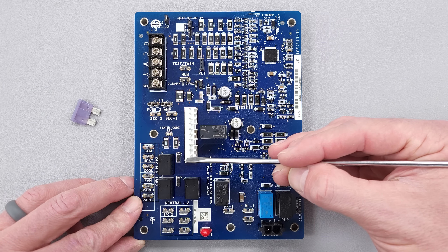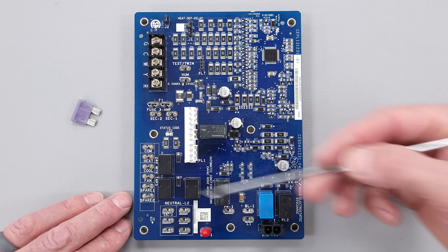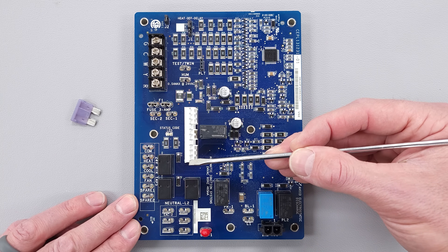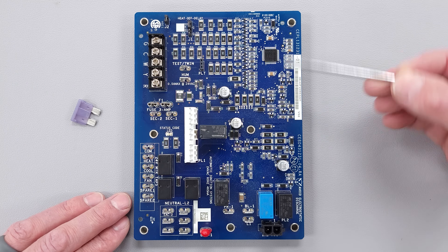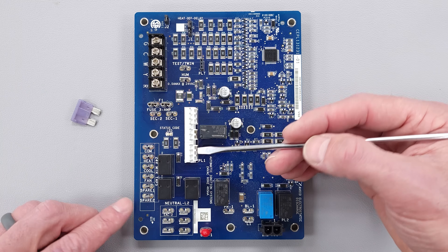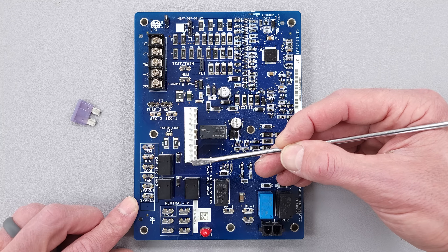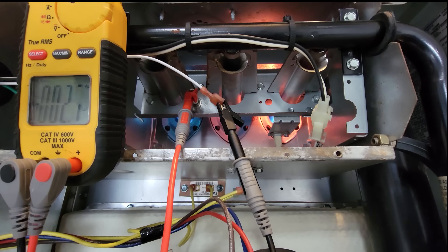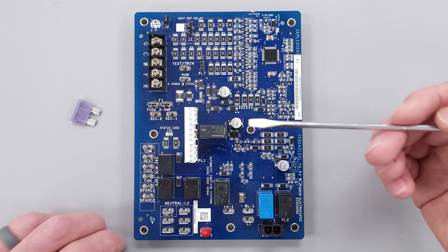Even if this fuse was broken, this circuit board is still going to send roughly 100 volts of power to the flame rod. This circuit board is always testing to see if there happens to be a flame - the flame completes the circuit between the flame rod and the burner retention head which is the ground. As long as there's power in and it has its 24-volt power, it's going to be sending something a little bit less than 120 volts over to the flame rod, and then the flame will convert that to microamp direct current if there is a flame present.